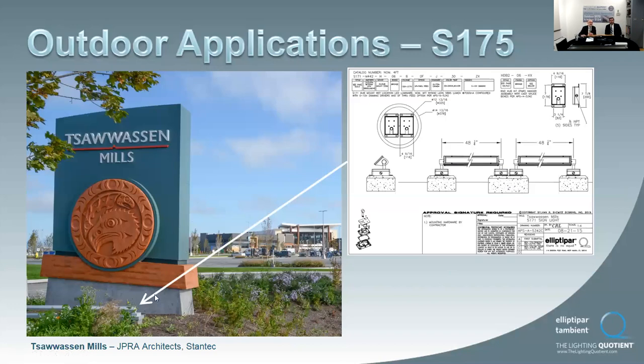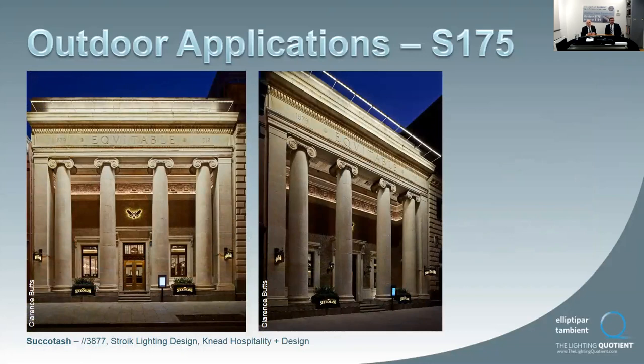You can see from this photo what they ultimately did was a little bit different than what was on the submittal drawing, but the key here was they used our cast splice box on a short bump up just to keep the fixtures some modest distance above grade, either for light snow accumulation or just to keep it out of wet dirt and mulch on a day-to-day basis.